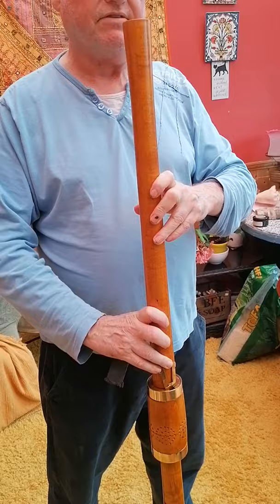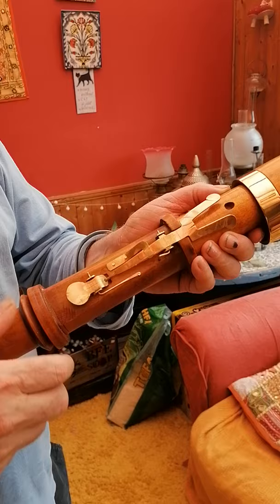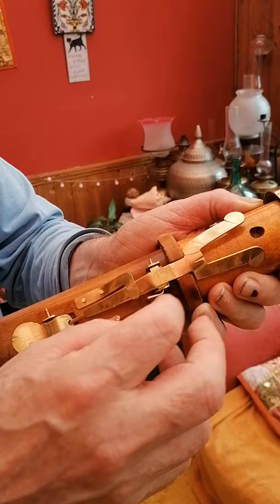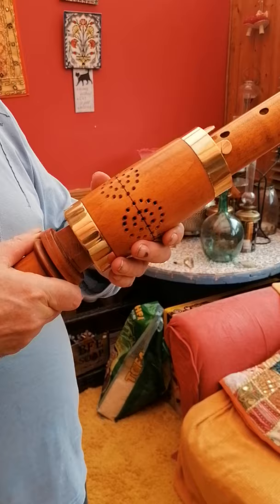While the camera's close, the key work is under here. Very simple. If you need to adjust it, there are two tiny screws here which press down this spring, which is what sets everything working. So if you lose some springiness, then you can just tighten that down a little bit more. So that's the main adjustment that there is, but you shouldn't have to do that, really.